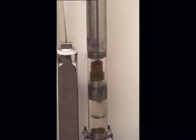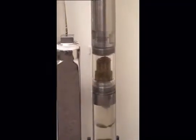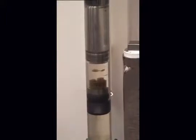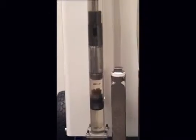Notice how much sand is on the FAR plunger side. The sand completely fills up the traveling valve cage. On the conventional side, there's a fraction of the sand present as compared to the FAR plunger side. Now we're going to listen in as we start the conventional plunger and show you what happens when sand is present inside the pump.